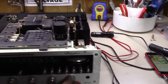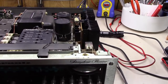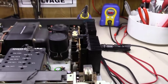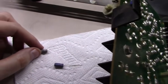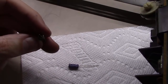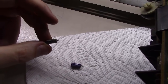I've finished this module and I'm testing it — making sure it's playing well before moving on to the next module. If I had some kind of problem, I'd want to troubleshoot it here versus having to troubleshoot the whole thing. Now getting into the first capacitor on this second output board — it's a 16 volt 10 microfarad — and if you can see, the end here is wet. This thing has actually been leaking. Good thing we went to this trouble, or it would have caused something bad pretty soon.